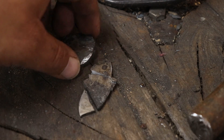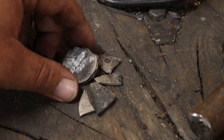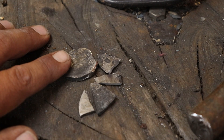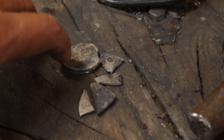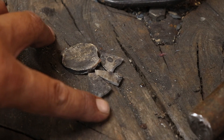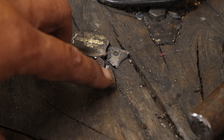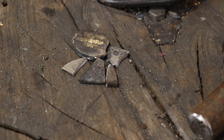I'm also going to do the next piece of the one-inch rebar in oil, just to see if it bends over. Right now I'm still pretty impressed with it for tooling — it's probably pretty tough and I can probably live with it. And I'm hoping this inch-and-five-eighths is tough enough that I can make some top fullers or something like that, a little more hammer-type stuff.